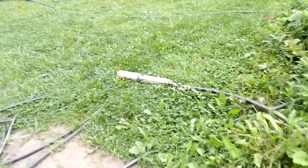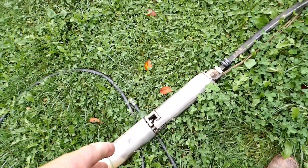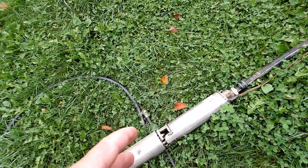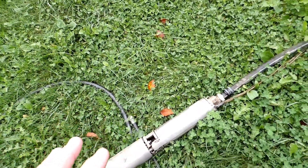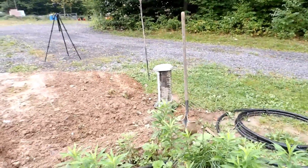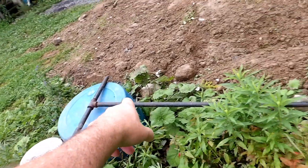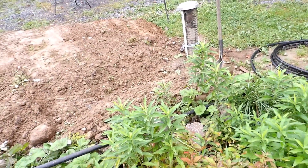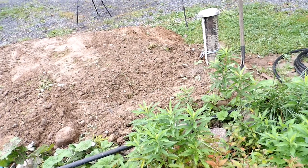You don't want water in there. This is kind of what's down there — this is Frank's test pump. My pump is a little smaller. He pulls a check valve out of these because he's putting them down wells and pulling them up, and it's just a lot lighter if you pull the check valve out so the water can go. But mine has a check valve because I want the water to stay in there. On the top of the line, four foot under the ground, instead of having this, I have a pitless adapter. You connect the top of it to a T-bar and you can lower it down and it just slides in together and forms a beautiful little match there so it doesn't leak.